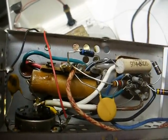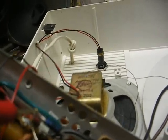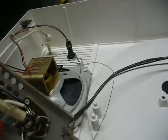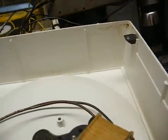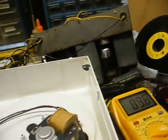Let's make some voltage measurements and try to see why this amplifier is silent. Let's check the DC output of the rectifier diode — we're on the cathode, and on the meter we're getting absolutely no DC voltage at all. Let's set our meter to AC and check the incoming AC going into this surge current limiting resistor. I should see the full line voltage, and I do. Going to the other end of the resistor, which connects to the anode of the diode, I'm only getting 43 volts coming out of that resistor.